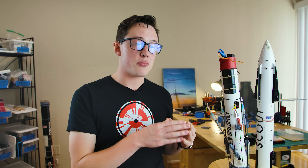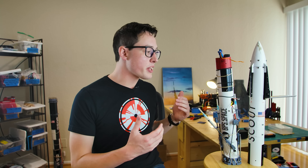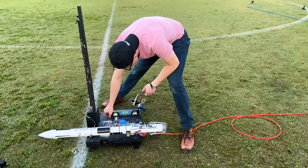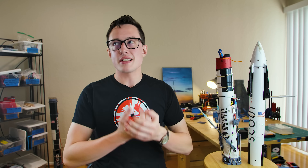Of course, this is great in theory, but it's difficult in practice because accelerometers are noisy devices, especially the cell phone-grade accelerometers and gyros that we're using on here. These are noisy sensors, and so as you propagate those errors forward, your estimate of where you are and how fast you're moving is going to degrade over time. The good news is that these flights are like 10 seconds maximum, so we don't have a lot of time to degrade over. The other problem that can contribute to dead reckoning errors over time is your initial estimates of where you are and where you're pointed. If you start out with data that is incorrect, that data is only going to get more incorrect as you go forward. One of the main things we focused on for this flight was knowing that the vehicle was perfectly vertical on the launch pad — something as low as 0.2 degrees can ruin your estimates over the course of 10 seconds.